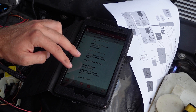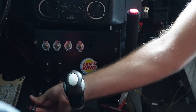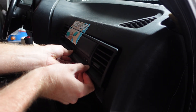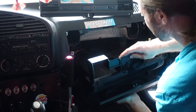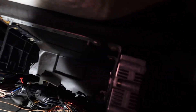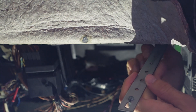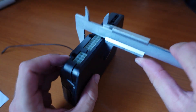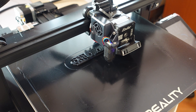Once I made sure it works, I could find a better place to mount the connector. I decided to put it on the control panel in the center of the car, with switches and buttons for various things. I had to feed the wires through the firewall, so I needed to disassemble the right side of the dash. I also decided to build a little terminal where the original alarm module used to be, so I can use it for power and ground sources for future interior mods. I measured it and the alarm module itself to make sure it wouldn't be too big and the glove box would still fit.